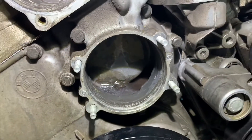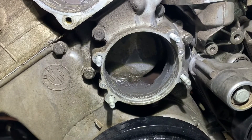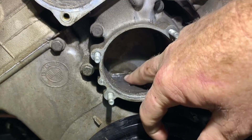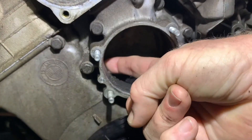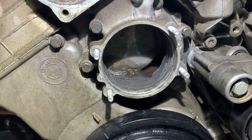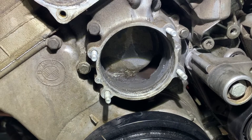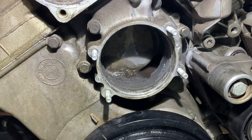It's not clear what caused it — it might be some kind of galvanic corrosion; it doesn't look mechanical. Effectively, the impeller runs in the back of the cavity and has to seal against the face inside. Now there's a massive gap through which water can escape, so the pumping efficiency is greatly diminished, with water churning past the impeller between the low pressure and high pressure side.